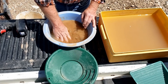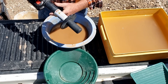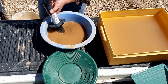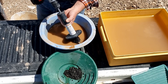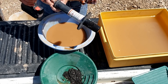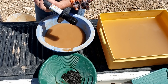What I like to do is take the concentrates in this bucket and tub, kind of smear it around, and hit it with the Spin-It-Off. For those of you who don't know about this, go to Spin-It-Off and you can find out more. It's a magnet that rotates around and picks up all the heavy magnetite-type black sand. What I like about this is that you can literally suck up all the magnetic black sand and dump it out, which actually saves a lot in your panning strategy and time. I've got it hooked up to a simple Harbor Freight twenty dollar battery powered drill to spin it.